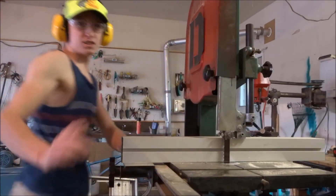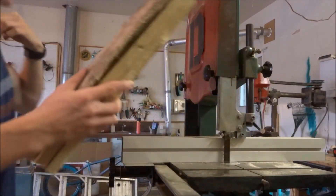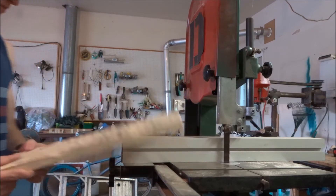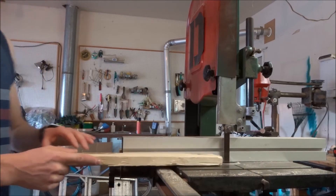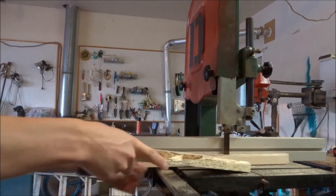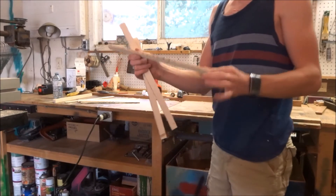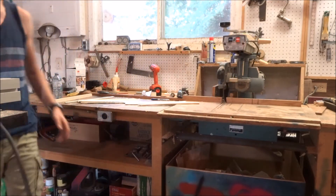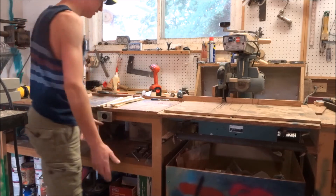So I've turned this around now so you guys can see what I'm doing, and I decided I'm just going to use the thickness of these pieces of wood as the width and height of the other pieces. So I need to make some big pieces and some thin pieces. Now I'm going to cut the thinner ones. I said I needed twelve cross pieces, and since each one of these is at least fifteen inches long, I'm going to make the pallet seven and a half by seven and a half. So I need six pieces total. We're definitely good.